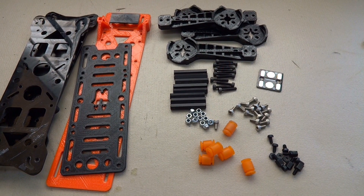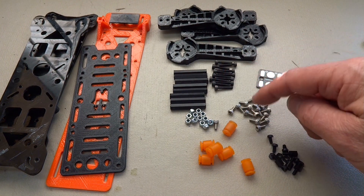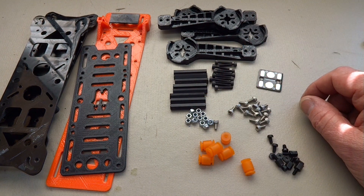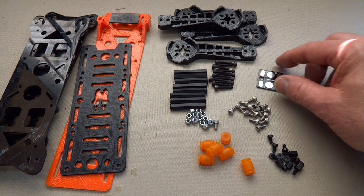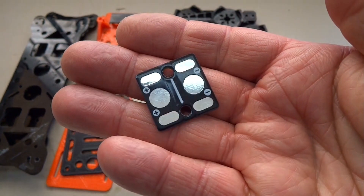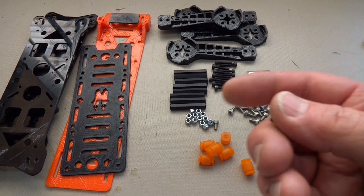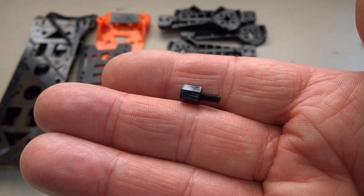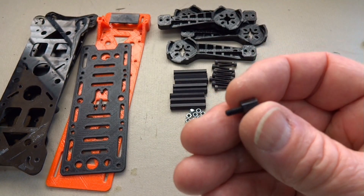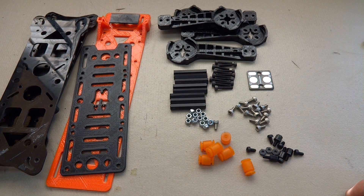You'll need some hardware. You can buy the kit from Hovership, but they were sold out so I went to Home Depot. You just need some M3 screws — 15mm and 5mm. I'll detail all of this in the description, but basically all the screws run about four dollars at Home Depot. One thing I do recommend buying from Hovership is this tiny little circuit board — it's your power distribution board, the smallest most compact one I've seen. You'll also need flight controller standoffs; they're six millimeter and run about two dollars. So we're about ten dollars into hardware so far.